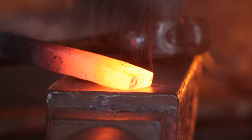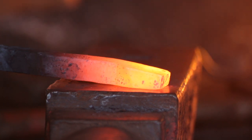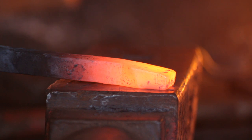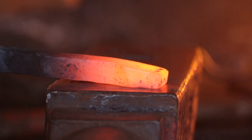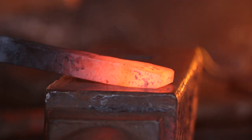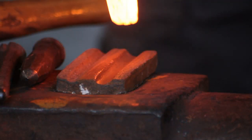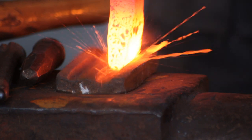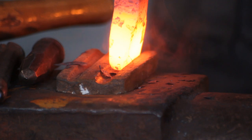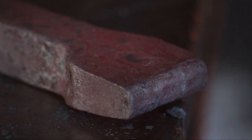At this stage I'm going to take the working face and chamfer the edges a little — those straight corners. That will allow me to go onto the bottom swage and round that face. For the peening action you want a nice rounded face that you can lead the edge of the scythe onto in order to sharpen it.